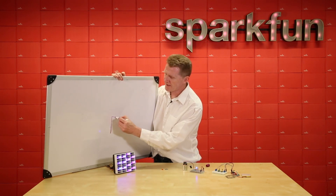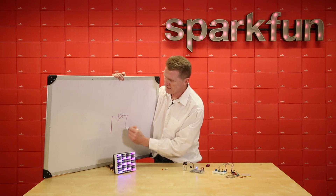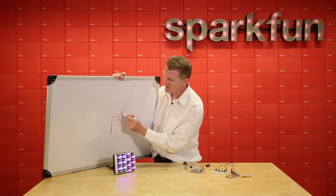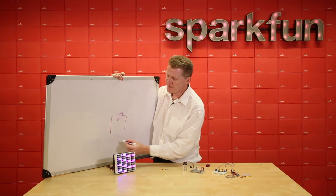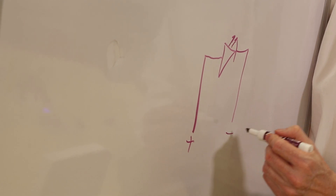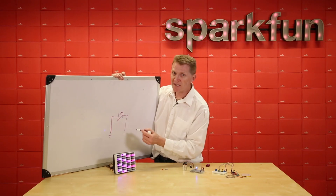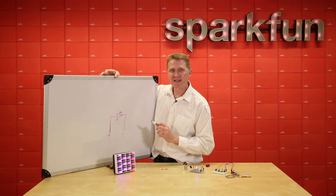Here is your LED in a circuit — a diode, give it a couple of arrows, and you're looking at an LED. You've got your power coming in here, ground on this side. As long as power is flowing this way, you're going to get LED illumination. If it's going the other way, you'll get nothing. We'll look at this further in a minute.